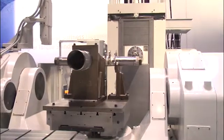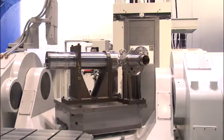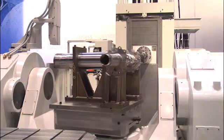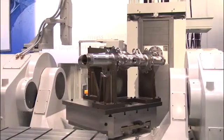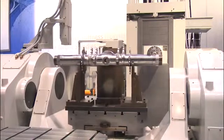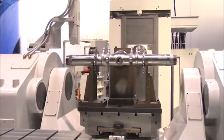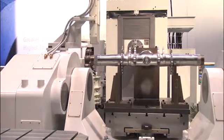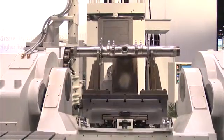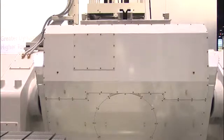This version of the machine has been ordered by a specific customer with an HSK 125 spindle — very heavy-duty cutting capability with 2,000 foot-pounds of torque for ultra-high performance machining of very difficult materials, including titanium 5553, tough steels, and other components. Our customers have been asking for a mid-size machine, competitively priced with extremely high metal removal rate capabilities. This machine satisfies that requirement. The HU100 5X remains one of Mitsui Seiki's most popular models and represents a major step forward in manufacturing aerospace components, mold and die, and the energy industries.